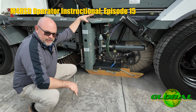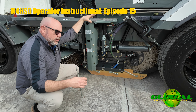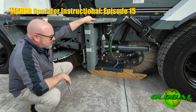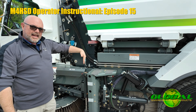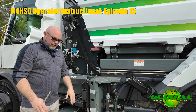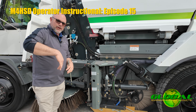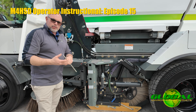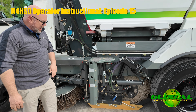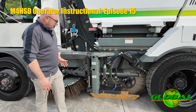The dirt shoe deflector is basically a metal ramp attached to the front of your elevator system that rides on a block on the inside of that poly dirt shoe. That poly dirt shoe is molded and has a wide ledge on the inside that this metal ramp will float up and down on. It acts as a ramp to keep funneling material in front of your pickup broom toward the front and onto the elevator system. You can see that ramp if you look straight down through the top of the elevator. Make sure it's resting on top of that block and hasn't been bent or damaged.